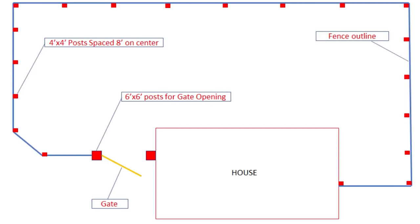Eight foot on center is right — that way you use a full 2x4 without waste. Your sideline depends on your layout. You can lay posts out with a remainder — the last section being your short section — or use a feathered approach, which is our preferred method, where the last two or three sections are less than eight feet so they blend into the rest of the fence. Aesthetically, it's more pleasing to the eye if each section is closer to being equal. Nothing structurally wrong with one short section, though.